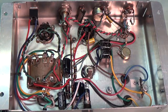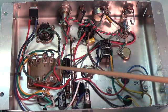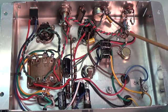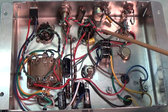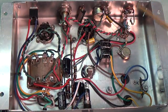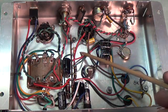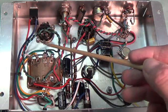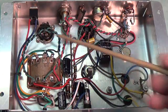First let's take a look at the overall wiring scheme, with the power supply isolated down here on the lower left with the filter capacitors and power transformer, and then the input jack and 12AX7 up here as far away as it can be and still be within the chassis. All of the alternating current filament wires are tightly twisted to cut down on hum. I found that running them up high and then coming down to the tube is better than running them along the chassis surface surrounding the tube — it tends to hum a little less. When they wrap around the tube, they can create a field between the two wires and cause a little bit of hum.